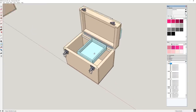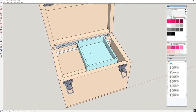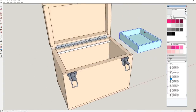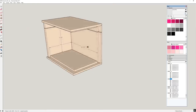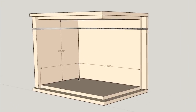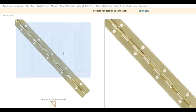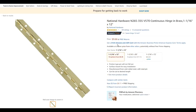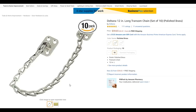Another option is to eliminate the divider altogether and just put a couple of cleats near the top where the tray would sit. In the cutaway you can see the actual inside dimensions. Measure a couple of the cans you want to fit upright — I'd go about eight and a half inches to make sure it's a comfortable fit. Here's the continuous hinge — the piano hinge — and you can get these in brass or stainless steel in different colors. Here's one of those chains to hold the lid up, and that also comes in different colors.